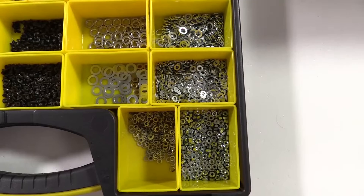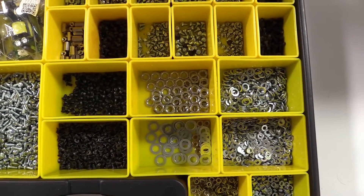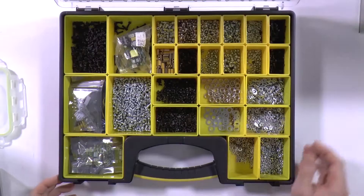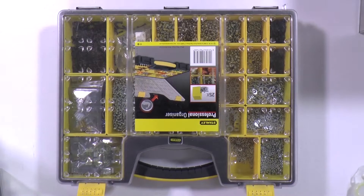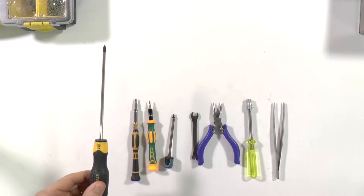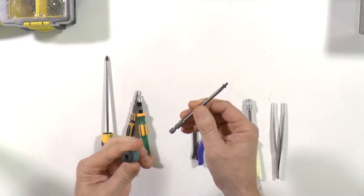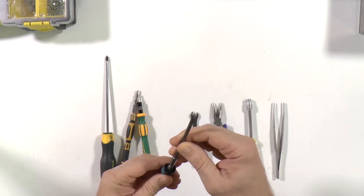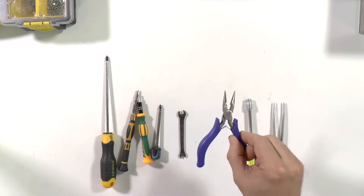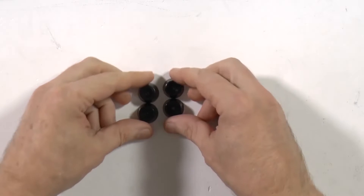Once the housing is done, let's start amplifier assembling. Even though it's relatively simple, we could be surprised by the amount of necessary assembling components. There is a set of most common 3mm metric screws. The best practice is to invest a couple of hundred euros once in a lifetime and never come back to this issue — you will get a fair price buying in packages, otherwise sourcing parts takes a lot of time and is 10 times more expensive. Tools needed include a good Phillips screwdriver, screwdrivers for two hexagonal head sizes, a Makita magnet for automatic screwdriver bits, a range of 3mm and 5mm, some pliers, wrench with screwdriver handle, and tweezers for hard-to-reach places.